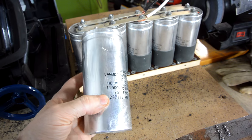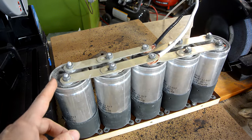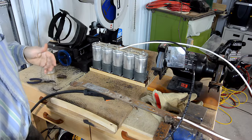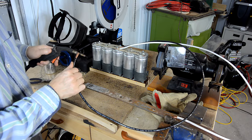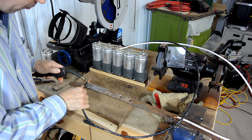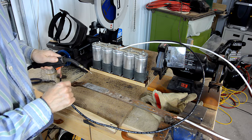These are 85 volts, 11,000 microfarads, and I've got five of them in parallel here to test with my welder. I've got the plus side of my capacitors hooked up to my piece of metal, and I'm just going to hold the negative on here while I try to weld a little bit — negative on here because it's negative supply on the electrode.